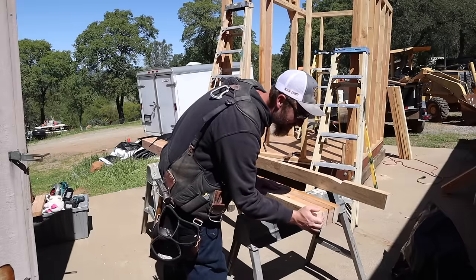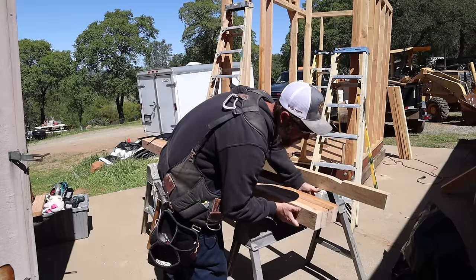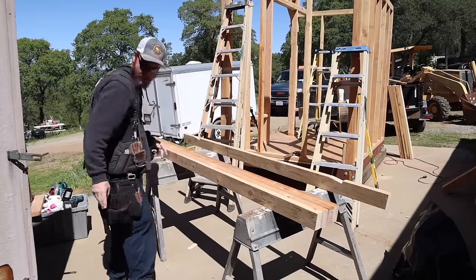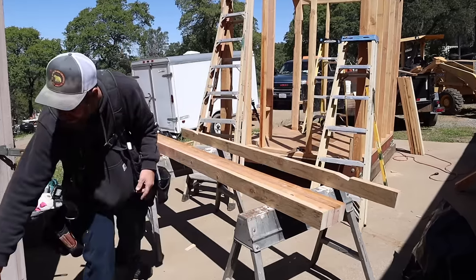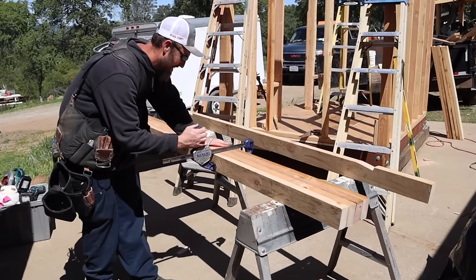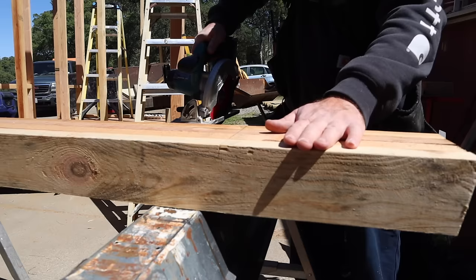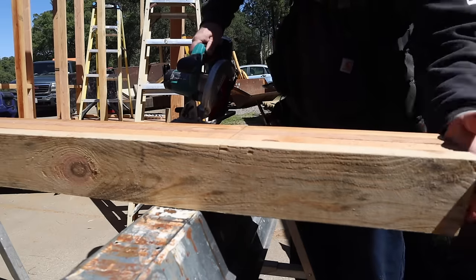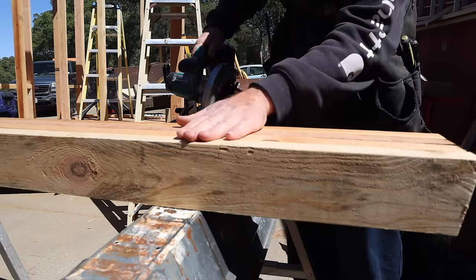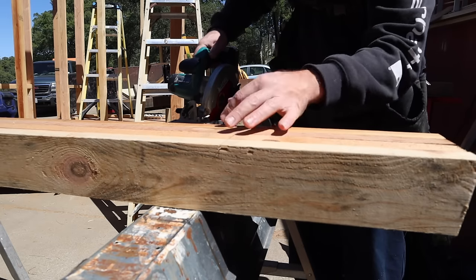To make life really easy, if you're comfortable with the skill saw, take all the boards you're trying to cut, line them all up, and get out the old bar clamp. Putting them together and lining them up, you can cut them all at once — at least this cut. That'll keep you from having variances when doing them individually. The shoulder cut, though, we're going to have to cut individually.